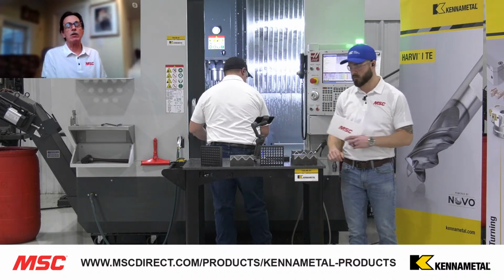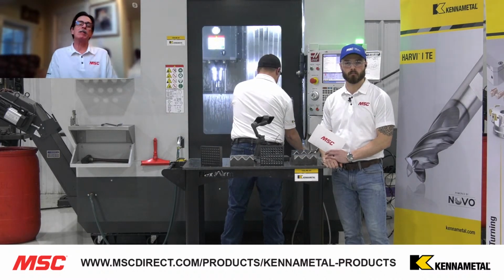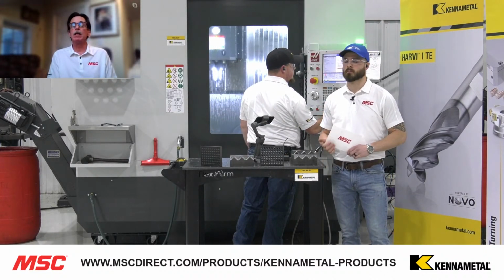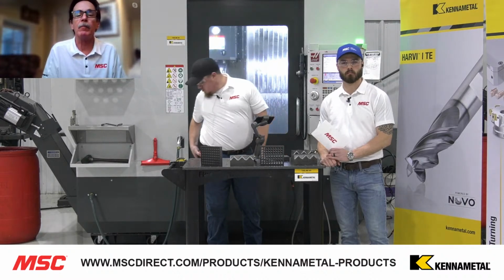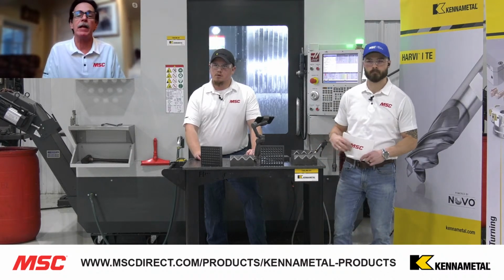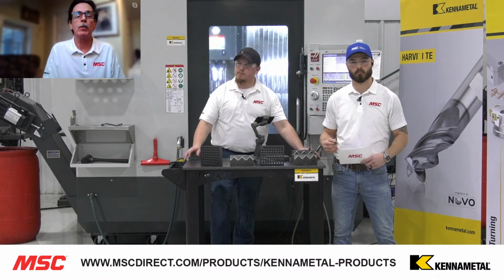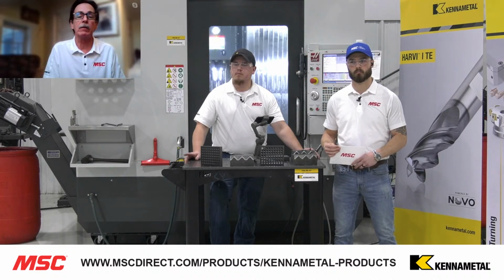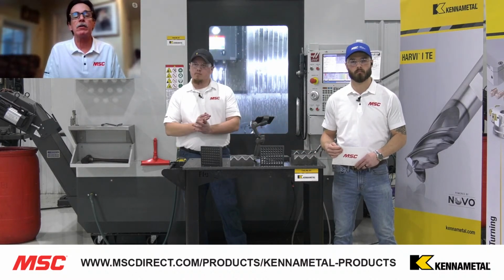Yeah, I mean, it all comes down to cost per part. When you look at analysis in the tool industry, your tooling cost is basically 3%, the actual tool cost. The rest of it is in time, in labor, and all the rest. So if you're thinking about buying an end mill and you're worried about an extra $10 to go to something generic, some general purpose, you're hurting yourself, because that tool will not get you to that cost per part. You need to take the highest performance cutter you can put in there. In the end, the tool's going to be cheaper because it's going to last longer, and it's certainly going to create a part faster. So it's not about that upfront cost, and we will document cost savings.